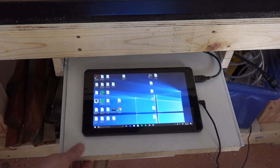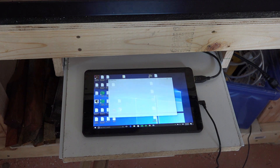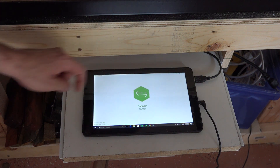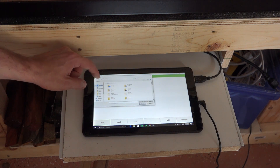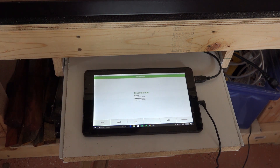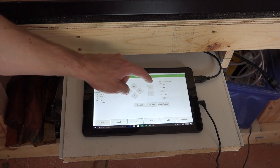You notice that I keep saying "set the parameters" — well, what parameters? How do you know what to set? This is probably the biggest learning curve for somebody without a machining background to overcome. When cutting softwoods, you can really get away with a lot, and the default outputs from Carbide Create will get you close enough. But when cutting metal, it's a huge deal. You can screw up your machine or send pieces of metal flying at high speeds across the room just by choosing the wrong settings.